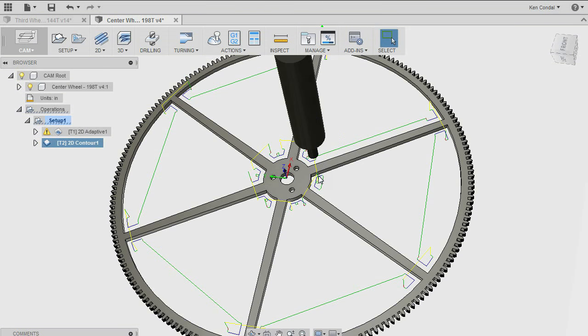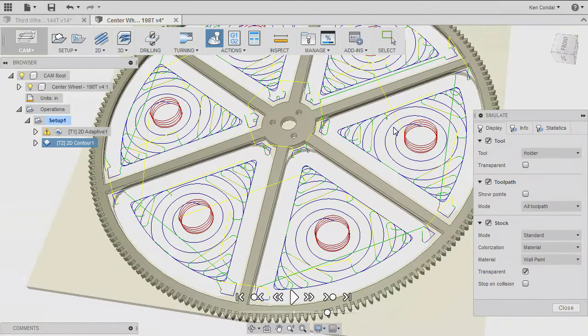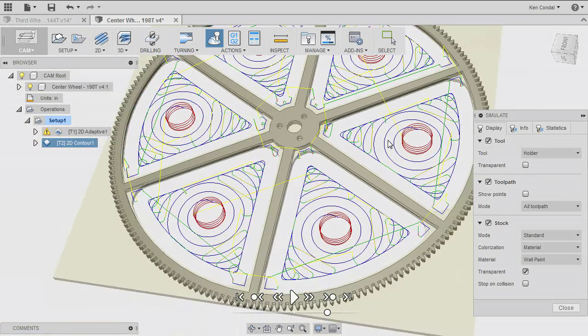So now the end mill is going to clear out these three corners that the 3/8 inch end mill couldn't clear out. A round end mill is never going to be able to get into a square corner, as you can imagine. So when you're using CNC rather than cutting this out by hand, you're always going to leave round corners. I happen to like the way that effect looks. If you don't, well then after all the CNC is done, you can come in here with a file and square these. Like I said, I like the way it looks, just the way it is.